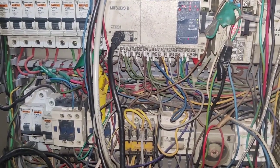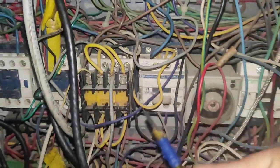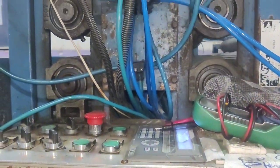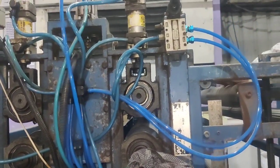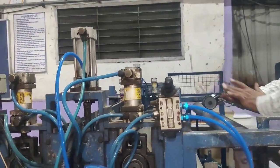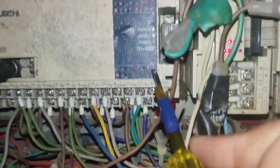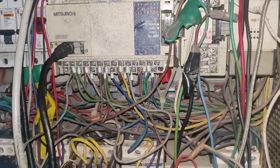First, you will see Y7. Y7 — you can see the 7 indicator is blinking and contactor is operating. When contactor is operating, machine is running. Now, because machine is stopped, for encoder command, we rotate encoder manually. When length is complete, machine will stop. You can see Y7 is cut. When Y7 is cut, contactor will stop.